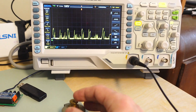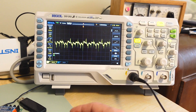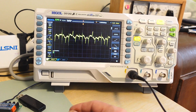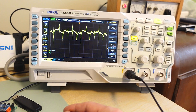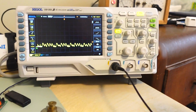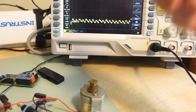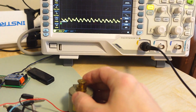So if I now slow this motor down a little bit, the current has become continuous because I've applied enough torque that it needs to run the motor continuously to maintain speed. I can also just turn down the voltage a little bit, and now the motor needs continuous current because there's not enough voltage to actually get up to speed, so that centrifugal switch never turns off.